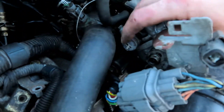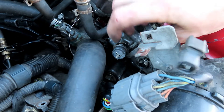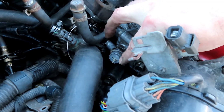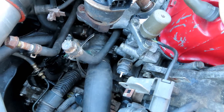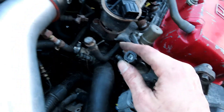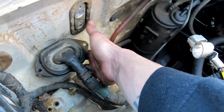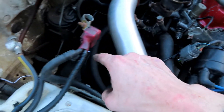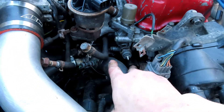My pressure switch - you can see the plastic around it broke, probably when I was putting the engine in and out or taking the head off. If you have the male part it will still fit onto those prongs, just be a little loose. If yours is broken, it is easiest to go to the junkyard and get another one, or you can get it at AutoZone - I think they're like $10, $15. I went ahead and already took out the battery tray. Slide the wire in underneath here and put it in. Now you guys can see where I ran it straight in through where the normal wiring harness goes.